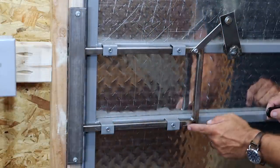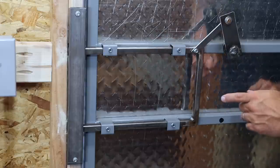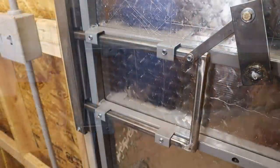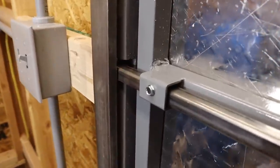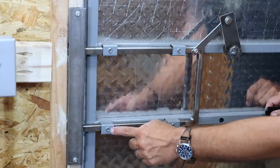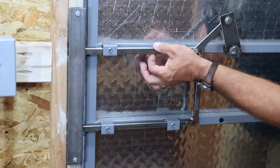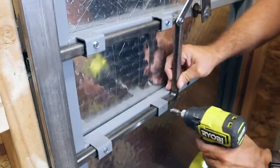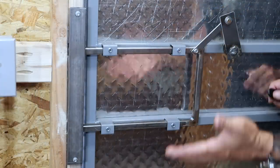You can see there is a U-shaped piece of steel right here — I made this out of half-inch by half-inch steel tubing. This U-shape sits in a track of four pieces of scrap one-inch tubing, the same tubing I used to frame out the door. I cut some little slices of it and welded it on, then added some sheet metal screws on the front to take up the space difference between the half-inch by half-inch tubing and the one-inch by one-inch tubing. That way it keeps it from rattling — before I had those sheet metal screws in there, the door had a lot more play in it, but now it's pretty secure.